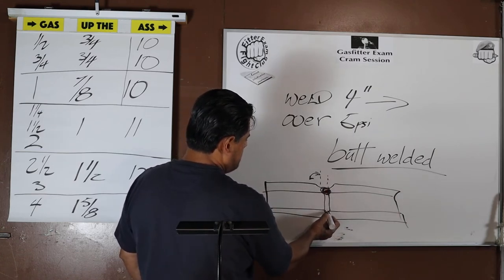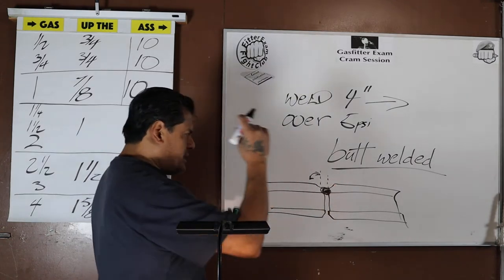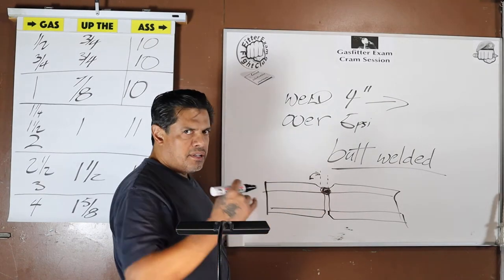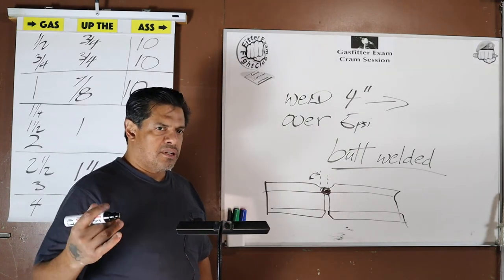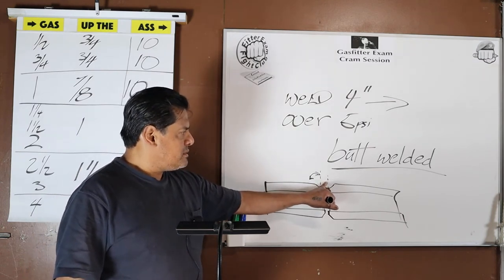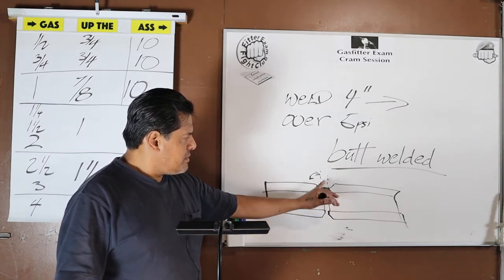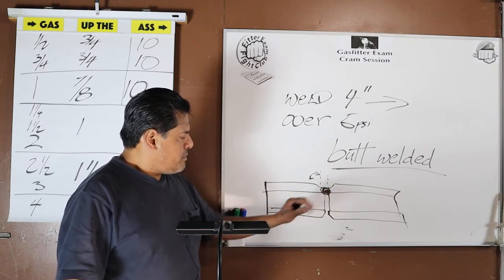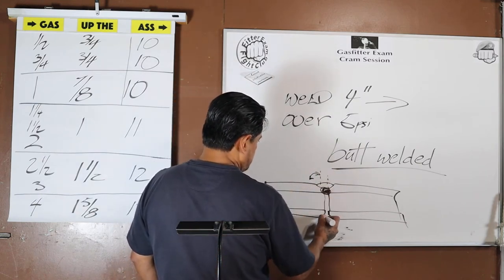These faces here for the root are so thin, so tiny, that it's not the biggest portion of the weld, because what we really want is a high quality, low hydrogen. Low hydrogen is going to translate to less impurities, less inclusions. That's the main body of the weld. But here, because the 60-10 is going to be a little easier, hotter, going to make sure we really burn in there. We start with the root pass as a 60-10. Then we're going to fill.